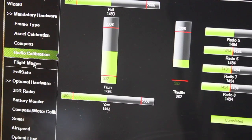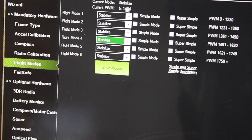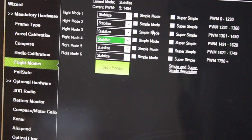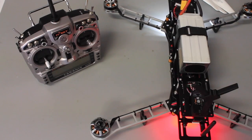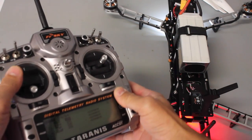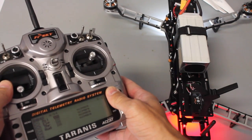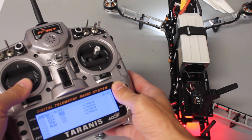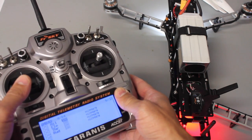Lastly, let's move to Flight Modes. Input is on channel 5. When setting up a new rig with Pixhawk, I always default to Stabilized mode. All these flight modes are set to Stabilized. I don't have anything configured for channel 5, so it defaults to Flight Mode 4 which is Stabilized — we'll save that configuration for a future video. Let's do a quick arm test and see what happens. I'll press the toggle and arm with my Taranis. If your compass calibration failed, you won't be able to arm. We hear that long beep — sounds good.